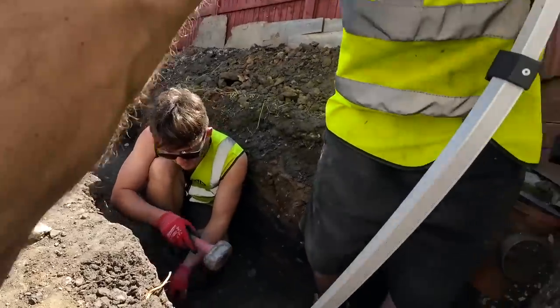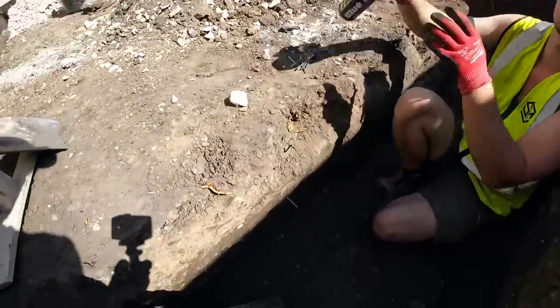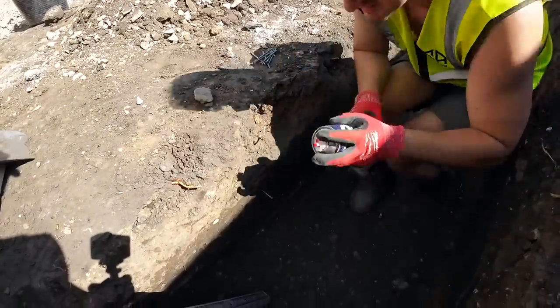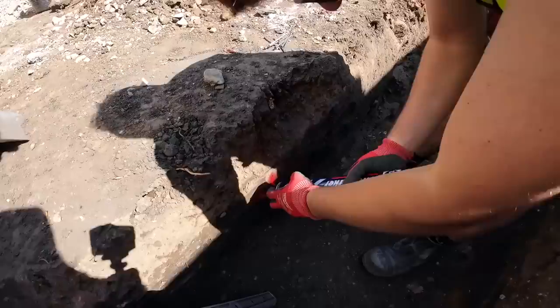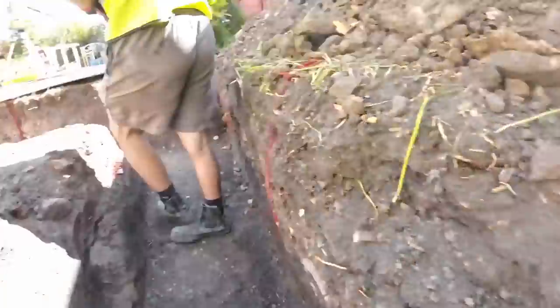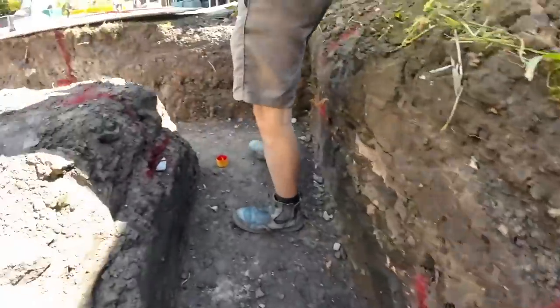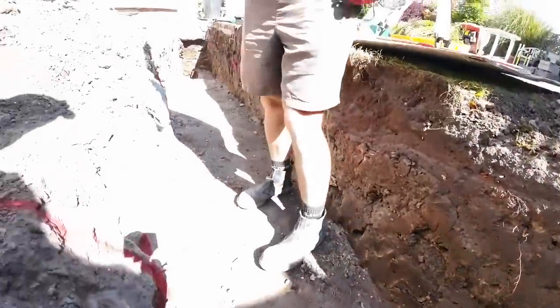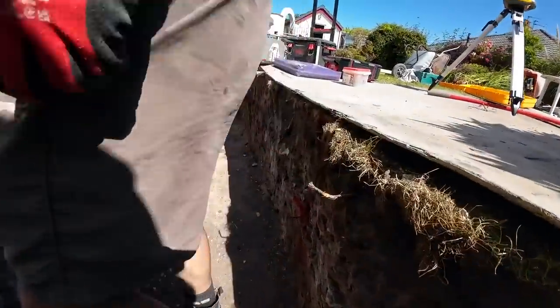How good clay soil it is, you have to hammer the nails in. Yeah. Luckily we have a machine on this side. Get one more in and then mark it on the wall. So there you go. Two, three. A couple of extras in the corners because you can always lose your level easy in the corners. And then we alternate going down the trench.